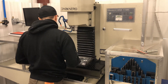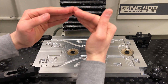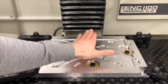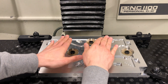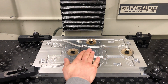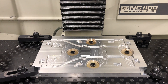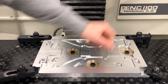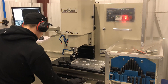When you bring it down onto your table, have a way to adequately clamp it. You can machine it flat on both sides but there could still be some bow left in it, so put your clamps down starting in the middle and work your way out to push that material flat. Now you also want to confirm it's square to your table — you don't want it sitting off-angle. So we machined in little pocket features on the back side that allow us to come in with our probe and confirm that it's square to our machine.